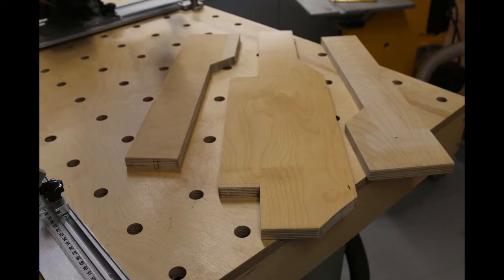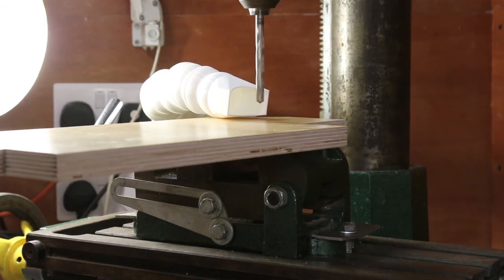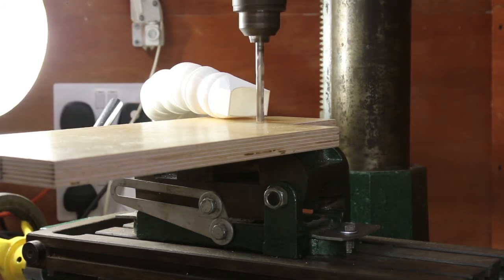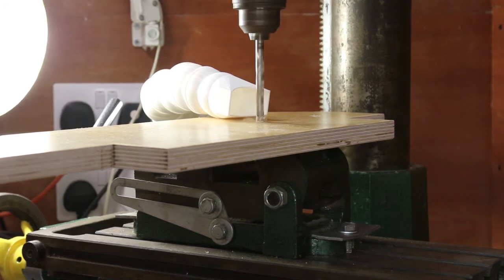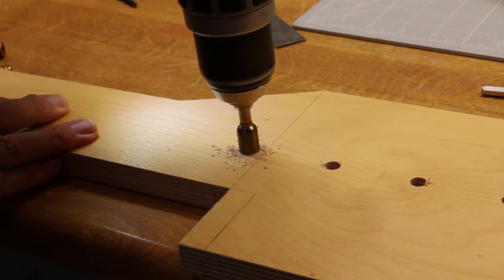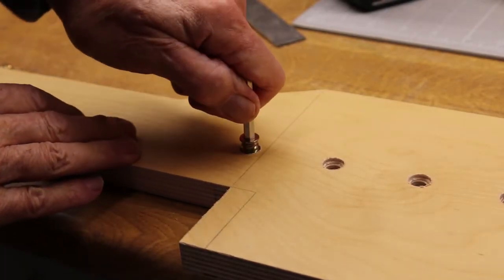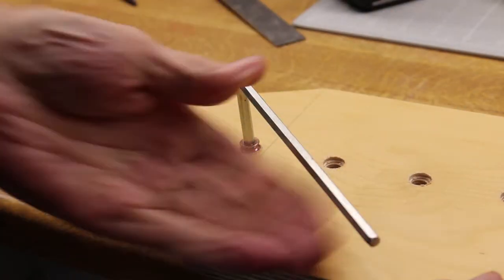The parts required were cut from 18mm Baltic ply, as seen. The first step in this construction was to fit a number of 6mm inserts for the clamps. These are the screwing type for strength and are countersunk. They make a tight, solid fit.